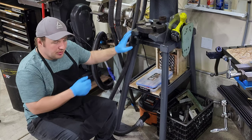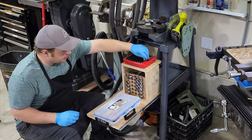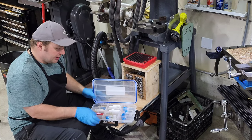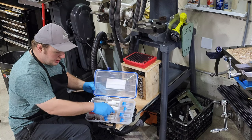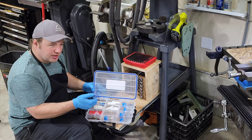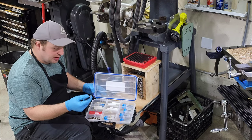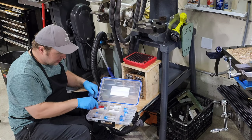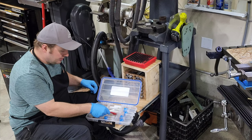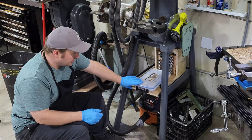Over here at my arbor press, this is where I keep other supplies for the milling machine. I have this tray that rolls out with my different-height parallels, from really low to the full-size parallels. I have the less common-use collets. And then this tray is how I organize all my end mills — the ones I do not keep inside their individual containers, that's just to remind myself they have chips on them. Like this one, the flutes at the bottom are all boogered up, but the ones on the side are just fine so I can still use it for side milling. Or if I have a part that's really going to tear up an end mill, I grab these ones first. I also have my edge finder and center finder here — I can put this in the mill and use it to zero my DRO. It's convenient and easy to grab, and when I'm done it slides back in, out of the way.